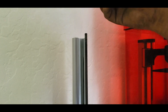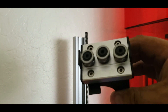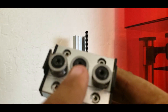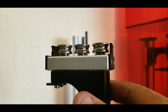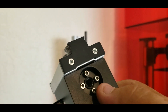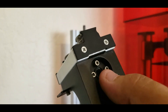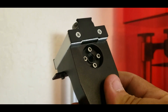There we go — the carriage just comes off. You'll notice there are three bearings back here. We'll be adjusting this center one to get a good grip where it's not super tight. You may ask about this without an anti-backlash nut — I'll address that in a little bit. For now, let's get this arm apart and show how to adjust that center bearing.